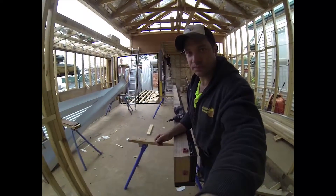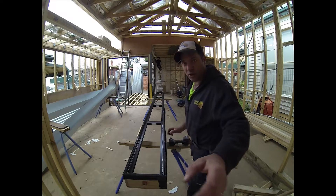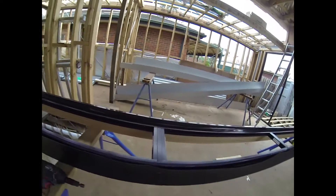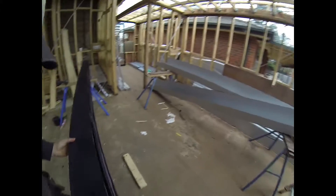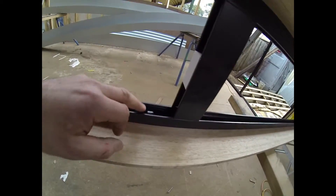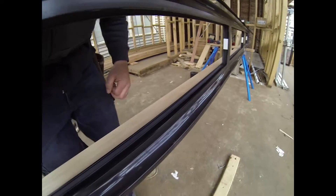If you have a look here, we have our aluminium frame running through. I've already plastic flashed the top along here, and this is the bottom. How do I know the difference between the top and the bottom? This has a place for our water to escape from our sill. So when the window sits up that way, the water can come in here. If it runs down and gets inside, you can see there's a place for the water to run out and then it'll just run off on the aluminium — so we've got no worries with that.